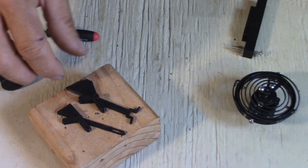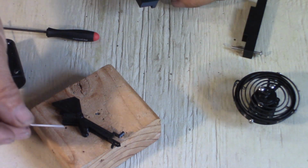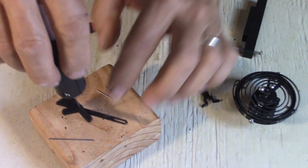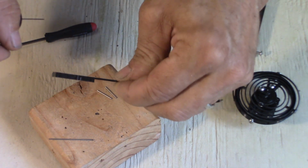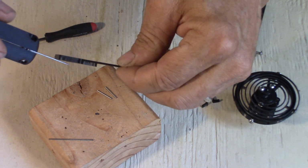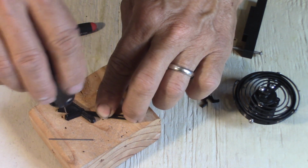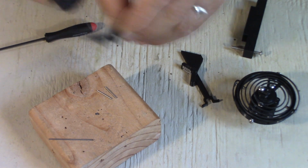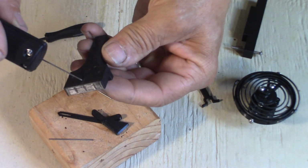The anchor is in 2 parts. They'll come on top of each other like this. And then there'll be one arbor and 2 pins. The thing to do is always starting from the back side. This is the back side. Holes are bigger, you can check. So start with the center hole. And then I have this tool to help. So there's 3 holes.